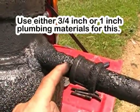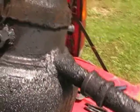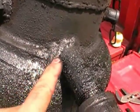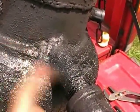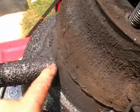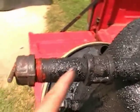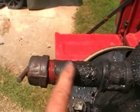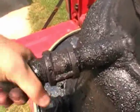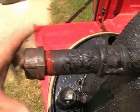Let's look at the side port ignition. This side port needs to be flush with the top of the lid, so you have to take your grinder and cut a mouse hole out of the rim so your pipe will sit flush. This pipe goes inside and sits right flush at the edge of the fire cone. I used a short threaded piece of pipe so I could find the exact length needed to come out of the gasifier. It literally unscrews, and when assembled I tighten it down with channel locks so it can't come loose.